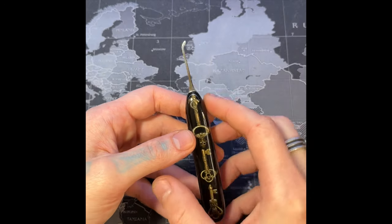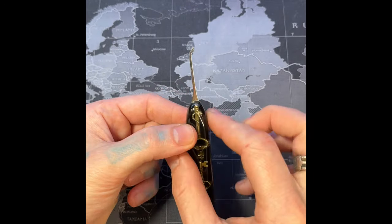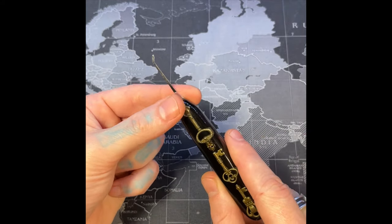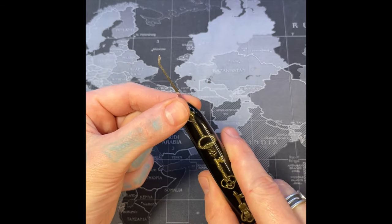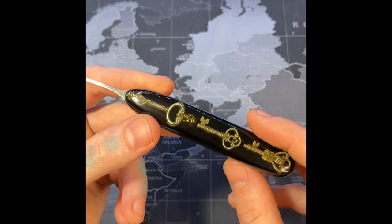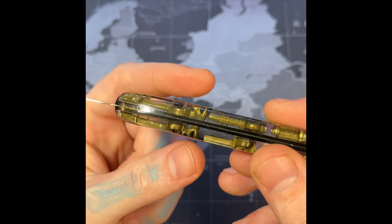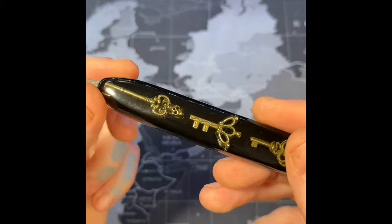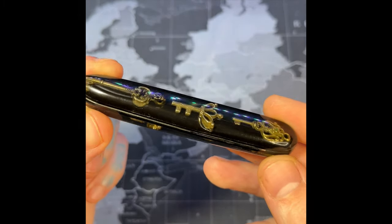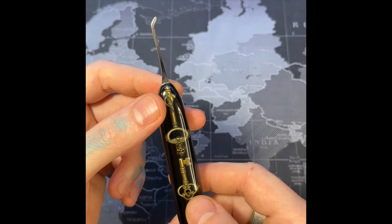After you're done gluing, remember that up until this point, every single bit of this was not sanded or shaped at all. It's just very blocky. The only part that's shaped and finalized is the tip right here. And when we're done gluing, we do the rest of this. The reason why we wait till the end is because some of these pieces can be really thick. You can see how close to the surface those are. So that's why I saved the sanding to the very, very end, so I can take my time, not overdo it beforehand, and not screw up.